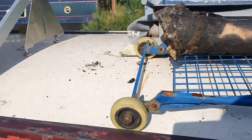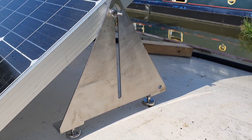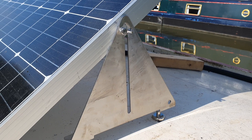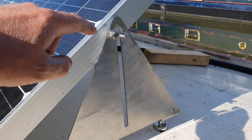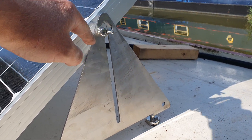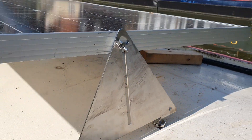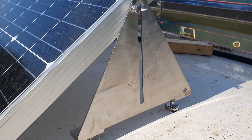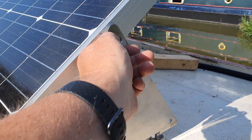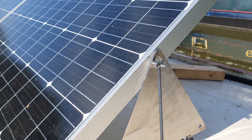So I've come up with the idea of using magnets. This is my mount bracket. Notice the little arrow up here — I've got little notches that I can place the bolts into to hold the solar panels a lot easier, and I can manoeuvre them a lot easier as well. If I just loosen off the wing nut, I can actually pick up the whole panel and drop it down flat.